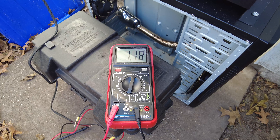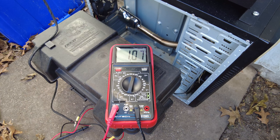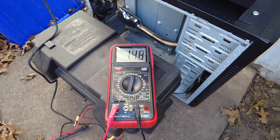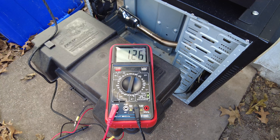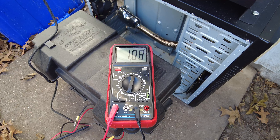5.5 is the top, 1.7 is the bottom. Let's go with 3.1 or something — somewhere around halfway. As you can see it's keeping under 1.5 amps draw. My voltage is showing 12.6 with it running at that setting. You can pretty well disregard that reading — I'm more or less looking at it for myself, because I'm running on batteries and I don't really know the condition of those batteries. I don't suspect they're in real good condition.